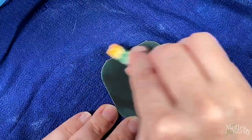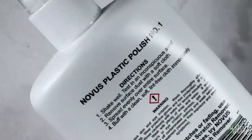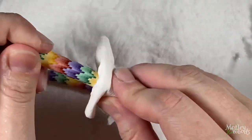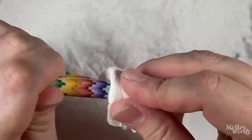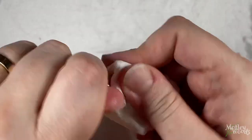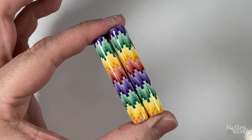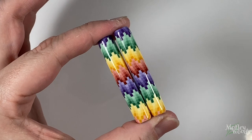Make sure to get the two ends where they pinch in towards the pen hardware so they aren't rougher than the rest of the pen. Just like before, it's important to sand back and forth and round and round — you don't want to leave any grooves in the pen barrel from going in only one direction. Now sand through all the grits of micromesh. Finally, I'm going to use some Novus Number One plastic polish. I have this because it's easy to apply on a lathe, but it does work by hand. You could also use any of your normal buffing methods.